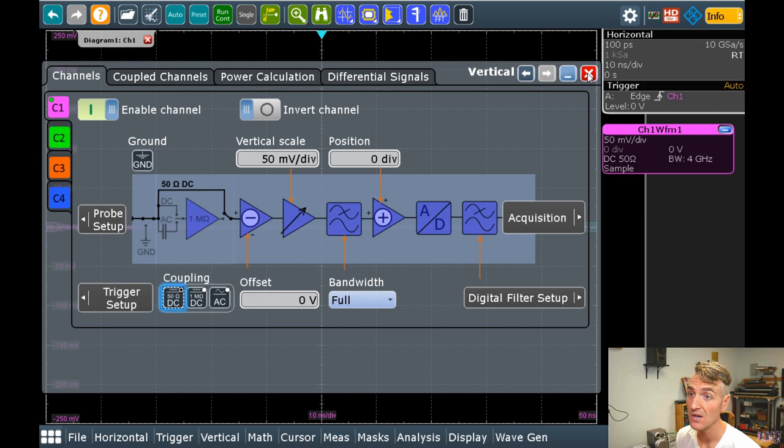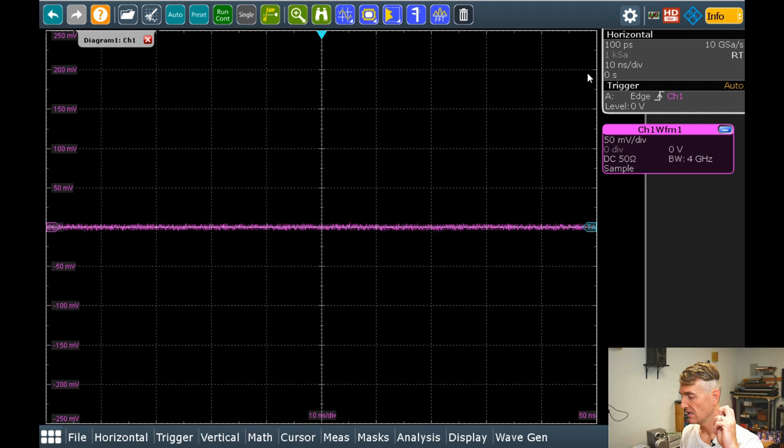in two places. Two places you'll always see interference, and that is 2.4 gigahertz, because, well, I have a 2.4 gigahertz Wi-Fi system in my house. You probably have a 2.4 gigahertz Wi-Fi system in your house. You also have a microwave that goes at 2.4 gigahertz. You have Bluetooth that, guess what? Also hangs out at 2.4 gigahertz. The 2.4 gigahertz band is a very popular band. It's called the ISM band.